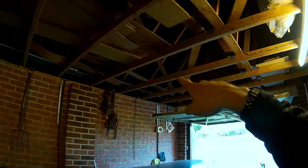And the socket, there's just one double socket up this end because all that's running here is a storage heater sometimes, battery chargers, things like that. So there's a single radial cable coming out of there on the 16 amp MCB, coming up along the roof and then down that trunking. As you can see, I have pulled the double socket off just to check that that is what the case is, and it is.